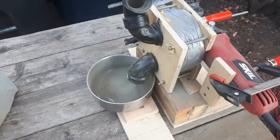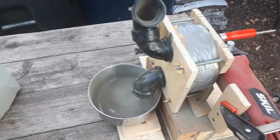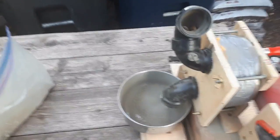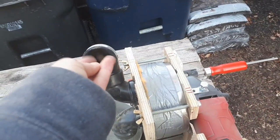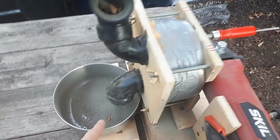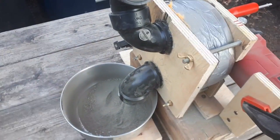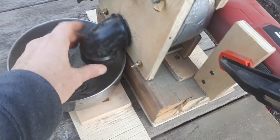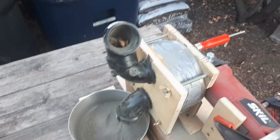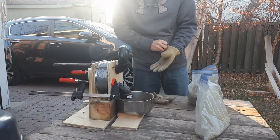I've got it all put back together and ready to go. You can see I've bolted in all the steel wear plates — I've only managed to cover about half of it, but the rocks enter around here and the mill spins in this direction, so full-size one-inch rocks will impact the plated area first, and by the time they make it around to the unplated side they should be pretty small. I'm just packing material into the inlet, the vibration rattles it slowly down into the crushing chamber, and it comes out the bottom as pretty fine material — unfortunately does make a lot of dust.